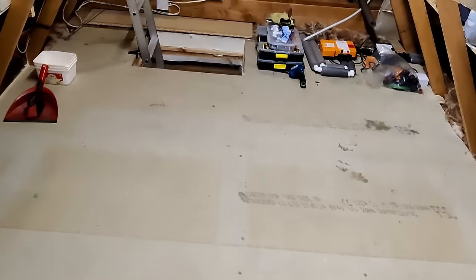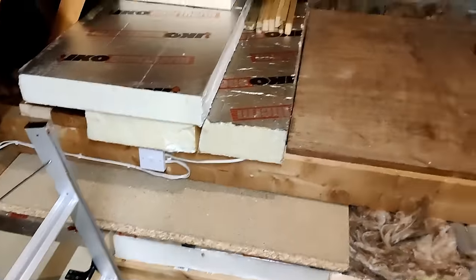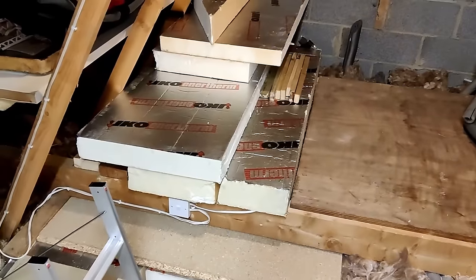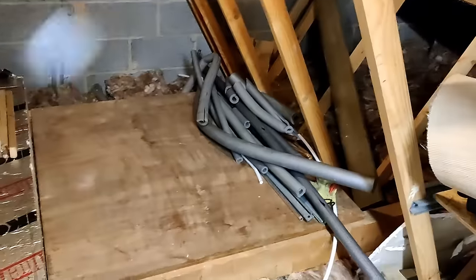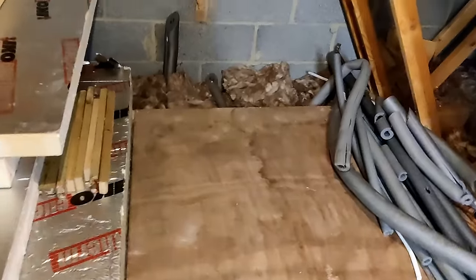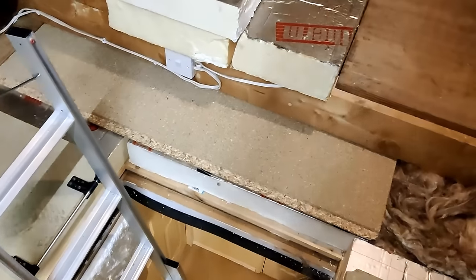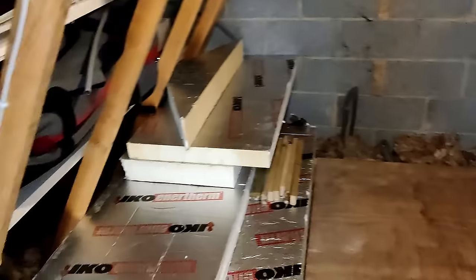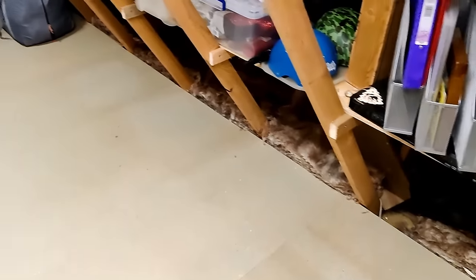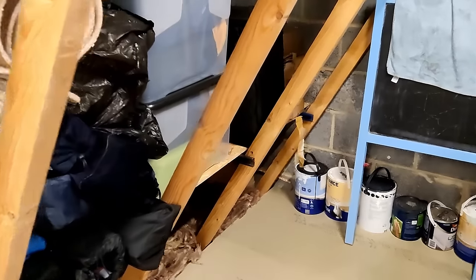We're going to call that good for now - we are now stuffed all the way up, no gaps, just continuous all the way on both sides. We've brought everything up nice and level around there, readjusted the ladders to work, moved the light switch over, dropped that board down. Later on I'll get another board for that space, but at the moment we've just got leftover building materials from various projects that I need to sort out. That's fully stuffed under there as well - you can see front and back, left and right. That board is just placed there at the moment, not screwed in or anything, but I think that's going to work. We're going to call that good - that's a well-insulated loft, and a lot more organised and tidy, although we could still do with thinning out what we've got up here.